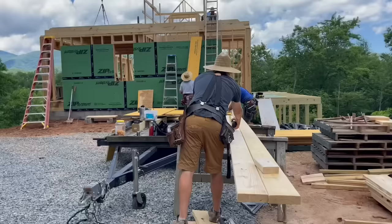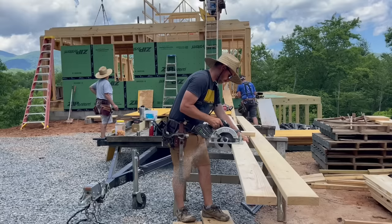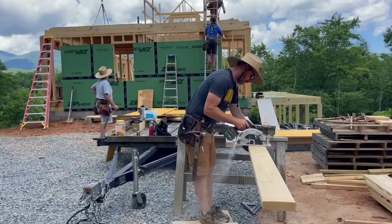While the other guys finished putting the subfloor down I decided to go ahead and do some math and start cutting the ridge post that will hold up our ridge beam on this house. The section I'm cutting here will actually be inside of a wall, but we just need to put up a post to start with and we'll frame the rest of the wall later. I'm also making it three and a half inches wide so that the three and a half inch wide double-ply LVL will sit completely on it.